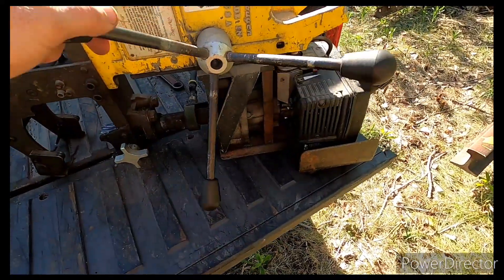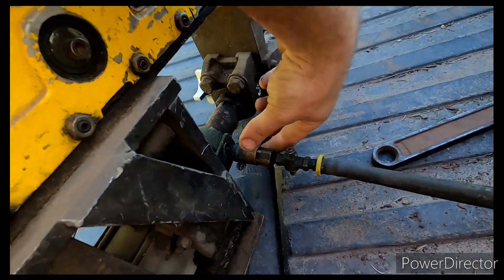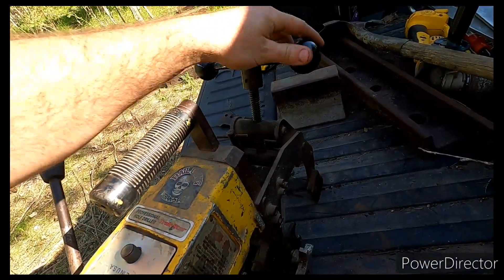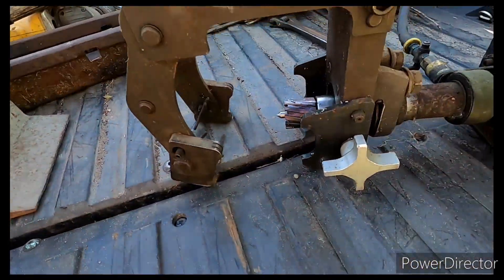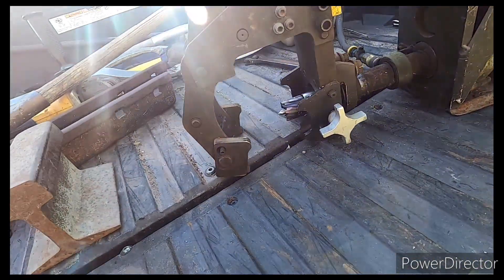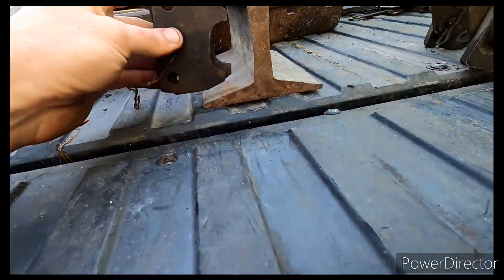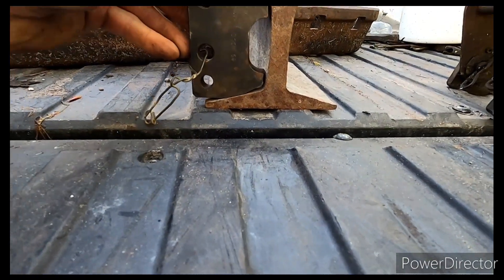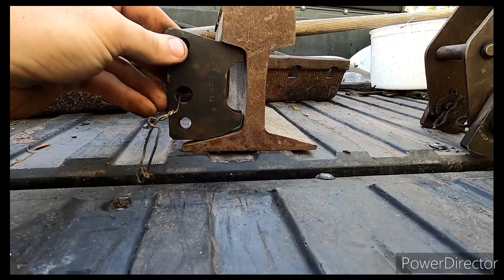I love this drill. It's manual feed. Your fluid hooks in there — just an air hose quick connect and a shut-off valve. You tighten it to the rail. I think I have five different types of shoes. Here's your hand-turn knob to take the shoes on and off. The shoes are pretty simple — it's an offset hole so you can't put them on upside down. They just fit right into the web.